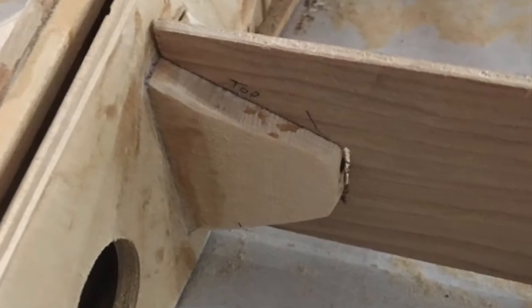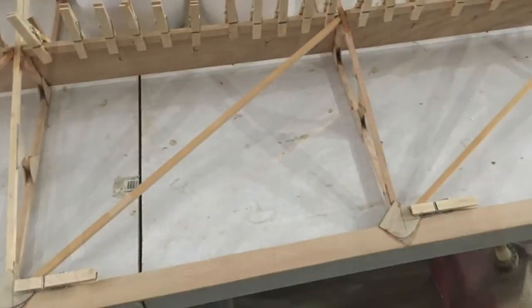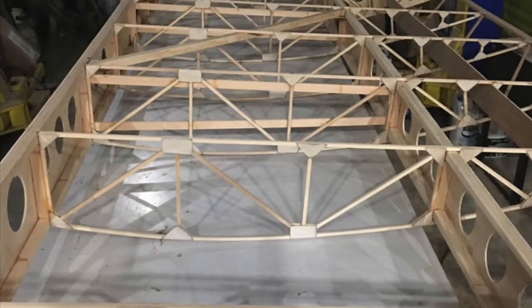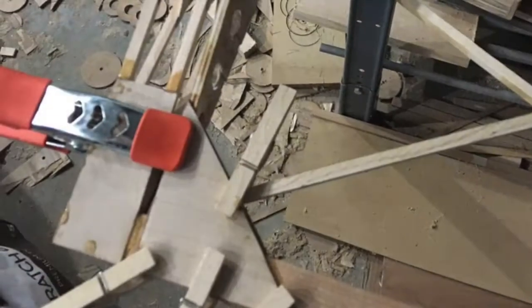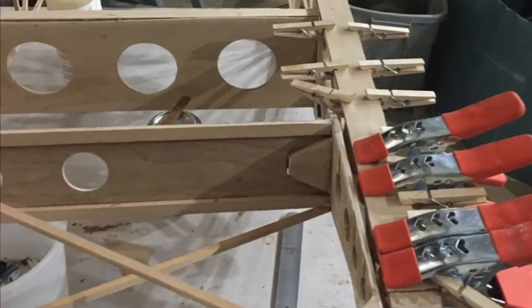Next we get to build the ailerons — this is getting exciting! I added the plywood for the aileron spars then glued on the doublers as per the plans. I also took this opportunity to glue in the diagonal cross braces for the ailerons. The next day I flipped the wing over and repeated the same process for the bottom side of the aileron. I also took this time to add plywood on the ends of all four ends of the wing to stiffen up those last two ribs.